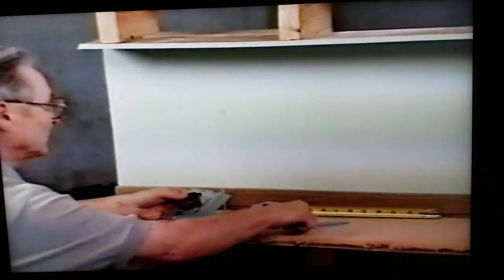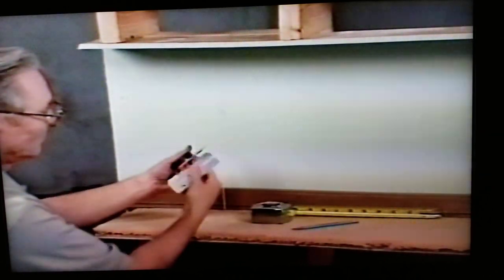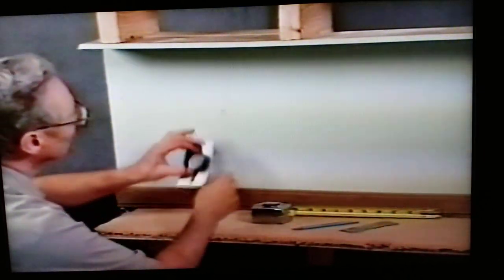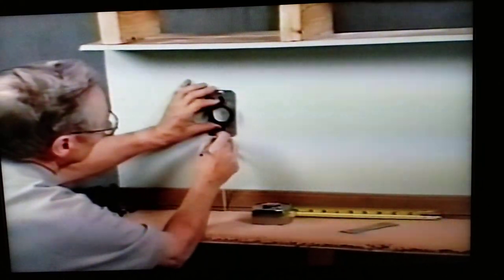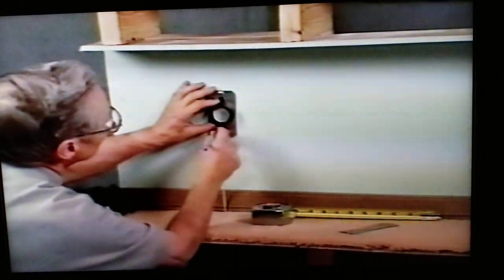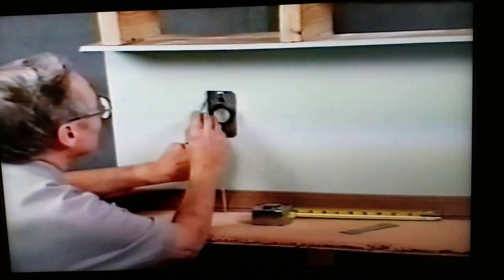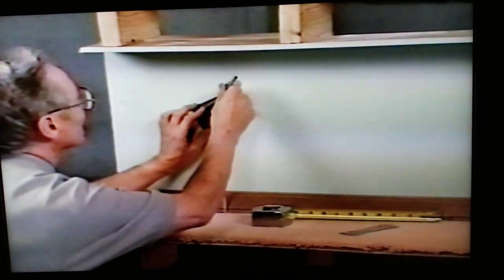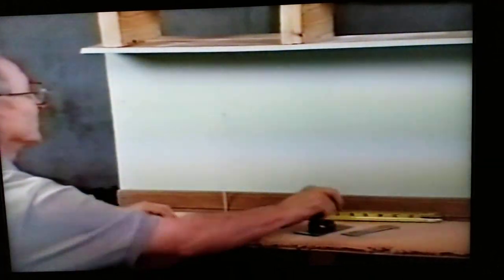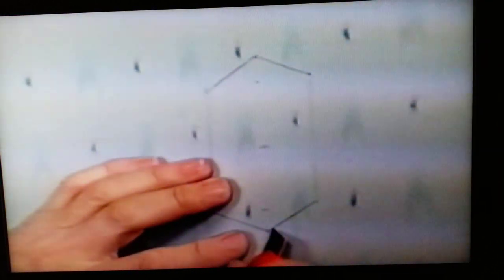This will be the center of your new inlet valve. Since I'm installing the inlet valve on an existing wall, I'll break off the new construction section from the side of the metal wall mounting bracket now. Then place this bracket, set it over the mark just made. Now mark the top and bottom screw holes and wire guide holes. Then draw a three inch line on both sides of the inlet bracket. If there's wallpaper on the wall, it's wise to cut it away with a sharp wallboard knife first, following the outline of the template on the paper.